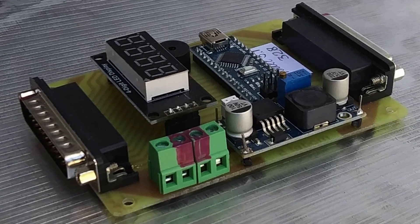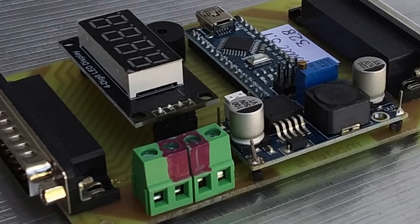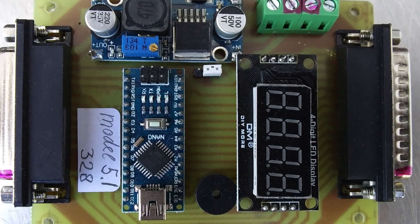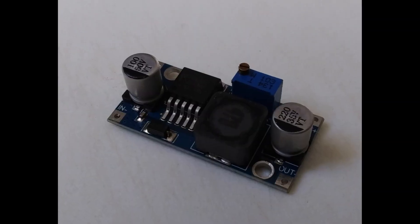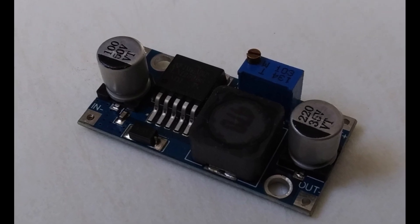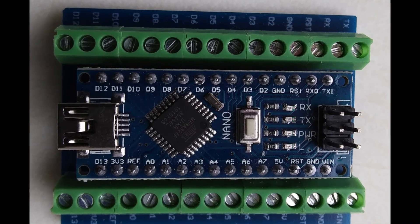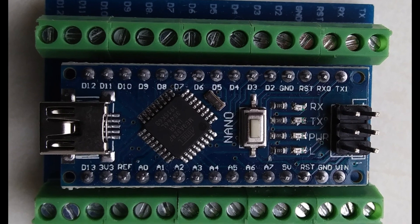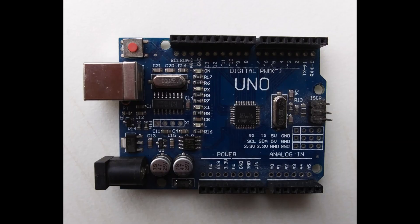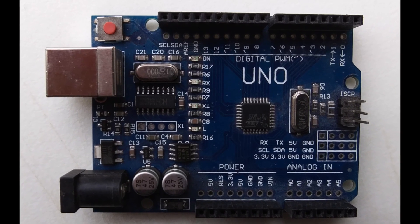CNC Controller. Our own CNC controller is based on the microprocessor ATmega 328. The control board has two standard DB25 ports for connecting wires via soldering. The built-in voltage regulator allows a wide range of input voltages from 5V DC to 35V DC. Those who don't have access to our controller could instead use the widely available Arduino Nano with the appropriate screw terminal adapter. Note that this Nano doesn't have an onboard voltage regulator, so you'd have to take care of that — or use the Arduino Uno with a built-in voltage regulator, although the board is twice as big in size.